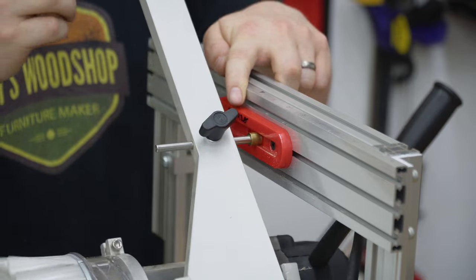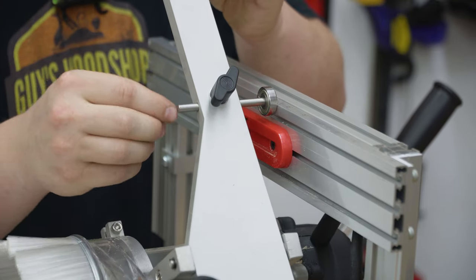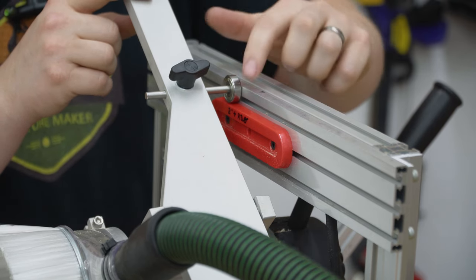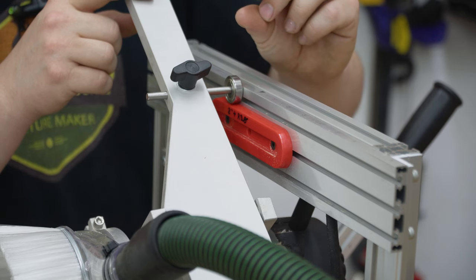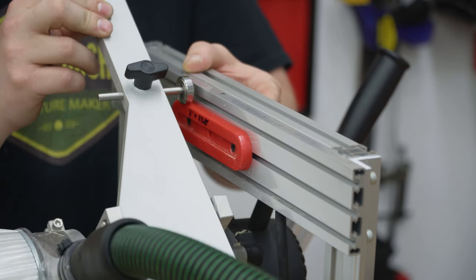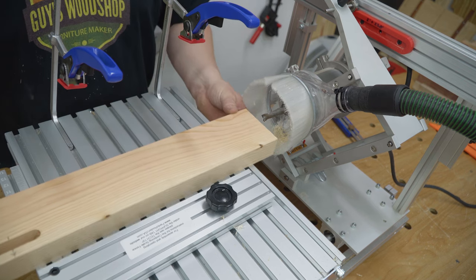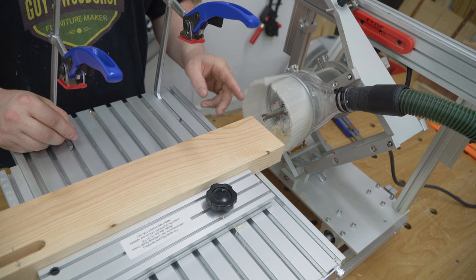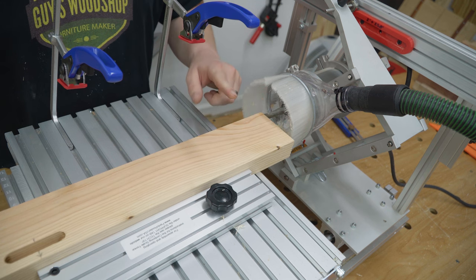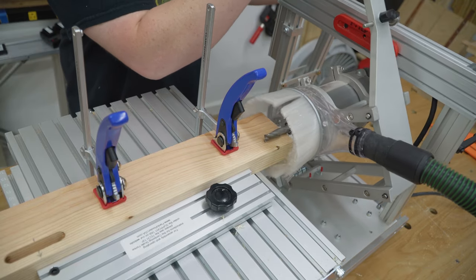With the bushing inside the middle of the template I was cutting the mortise. I'm done with all my mortises, so I can remove this bushing and replace it with a larger diameter bushing — which in this case is actually a bearing — and it rides along the perimeter. The perimeter is sloped: the closest towards the fence will yield a thicker tenon, and the further away from the fence, the thinner the tenon will get. I cut a test tenon and figured out that this bearing location results in the best fitting tenon. Batching out all the tenons will be really quick because I have the fence set to the appropriate width and I can set my material in place and it'll always be centered. I have two stops on the router placement — one in the back direction so I can push my material up against the bit to locate it, and a second depth stop that determines the total plunge depth for each tenon.